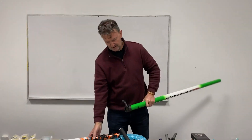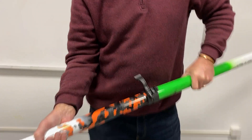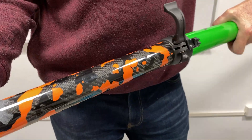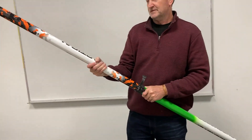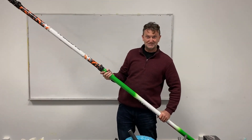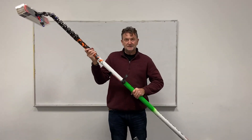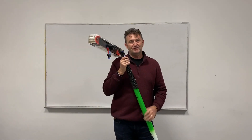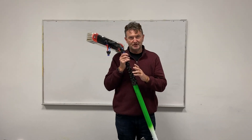Just to give you an idea: you will be dead in 0.3 seconds if you contact power with a carbon fiber pole — it has perfect conductivity. 0.3 seconds — you won't know what's happening, you're just here and then you're not here. So this is a lifesaver. We used to have pole skins, and we've had a guy just explode his pole. But last year, a guy in America was early in the morning, walking a fully extended pole, and he touched a power line and just dropped dead right there.